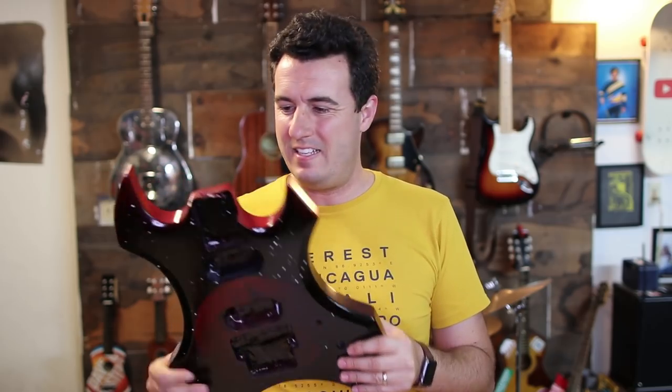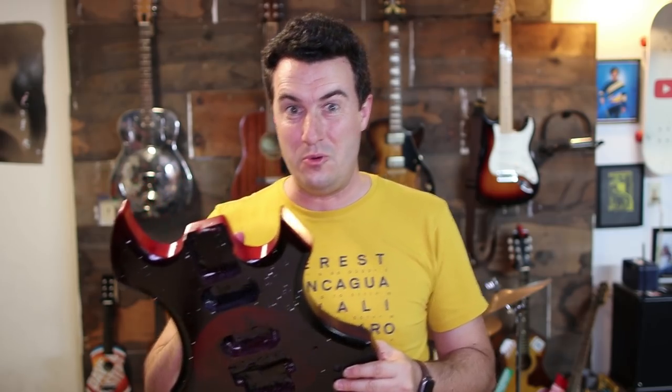Let's start doing some wet sanding and see if we can get this nice and smooth. I should say that wet sanding is a new thing for me — it didn't work for me last time. I've seen conflicting things online about how you should wet sand and how long the lacquer should wait. What I'm doing is using a spray bottle with dish soap and water, and sandpaper made for wet sanding, trying to get to a real fine grit because that's what's gonna give us our shine.